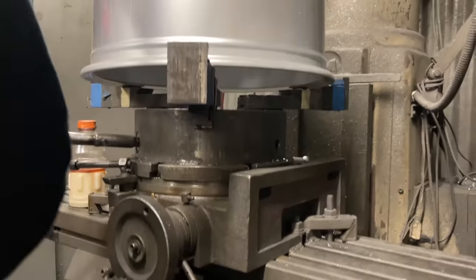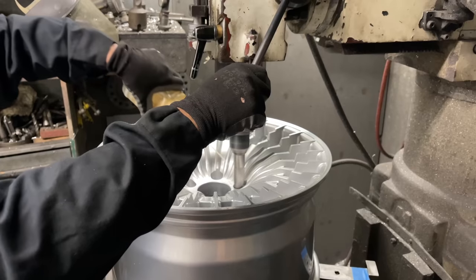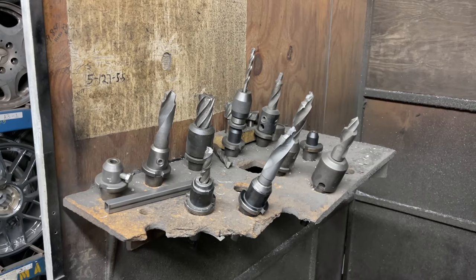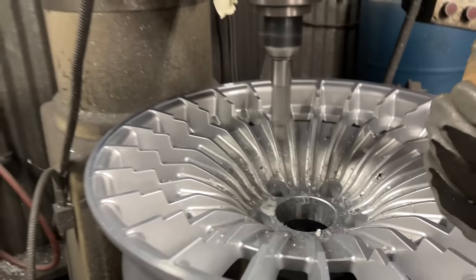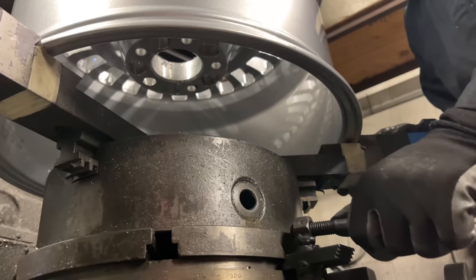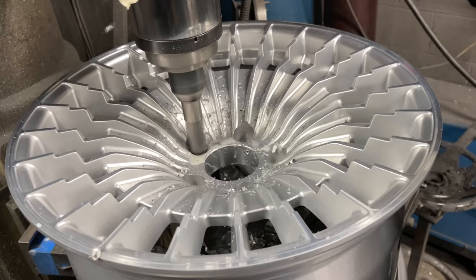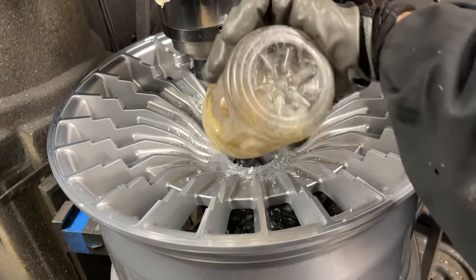And so here is Bonnie herself, or is it April, I don't know, drilling the hole slightly wider. To accommodate a 6.4 millimeter difference, each hole needs to move or be bigger by 3.2 millimeters. But the torturous looking drill that they're using is a bit bigger than that to allow room for an insert to go in later. I'm afraid. Me too, buddy. Me too. Now, I'm not sure why April keeps squirting orange juice from her lunchbox onto it, but I'm guessing it's to help with the drill temperature and travel.